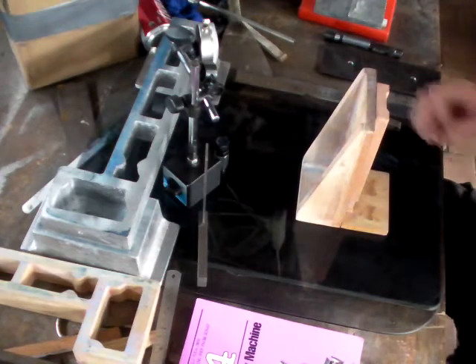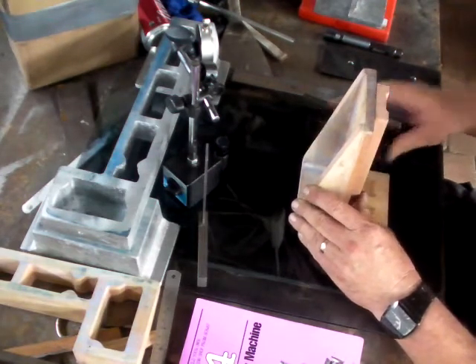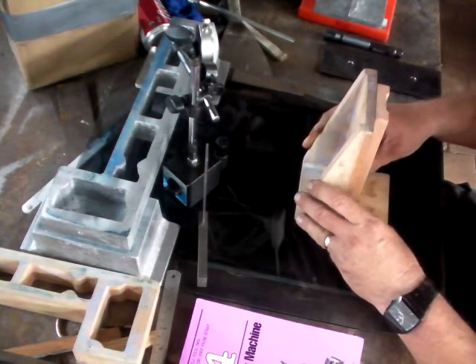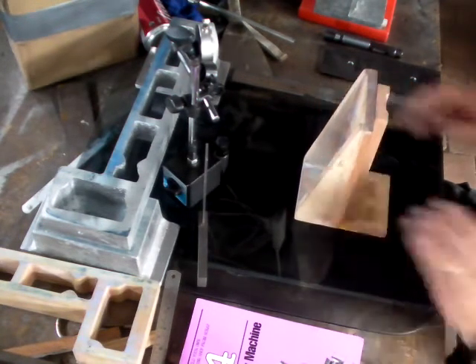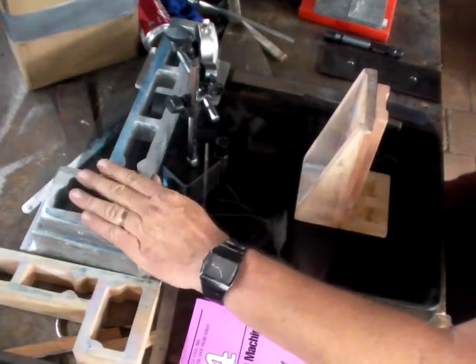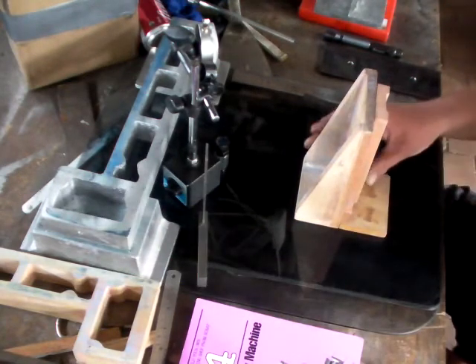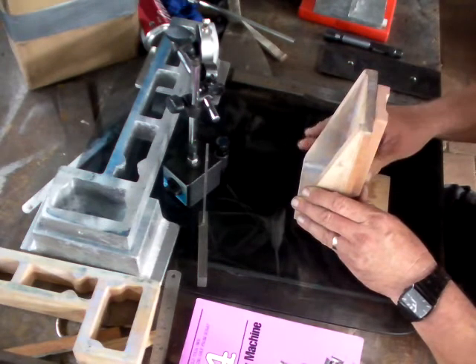The more accurate you are, the more accurate the casting and the less filing and adjustment required to make it all perpendicular, square, 90 degrees — all those technical aspects of how this has to interact with the base. The base is now filed and scraped even and leveled, and this has to be made so that it fits on the base square.